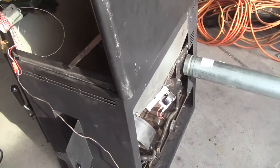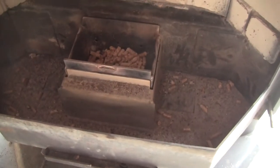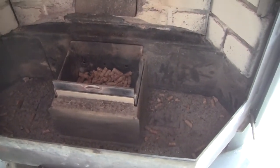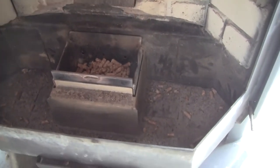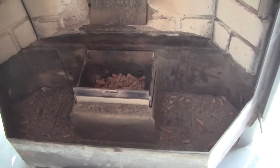I'm going to test this thing out here again to see if that improvement to the fan makes any difference on the output. I thought the pellets weren't starting up fast enough last night after I dropped it. I vacuumed out underneath the pot and took a wire brush on a drill and cleaned off the bottom and top of the pot. I thought there were some very hard carbon deposits, and that'll change the airflow a little bit. It's kind of messy, but that's after using super cheap pellets for an hour burn. I'll clean all this up again, but right now I'm just trying to make sure it functions properly after I dropped it.